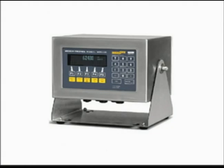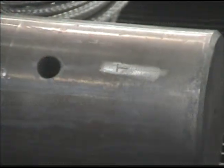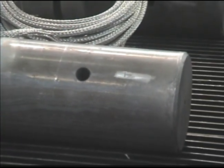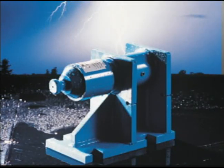Weight values can be expressed in pounds, grams, gallons, kilograms, tons, or liters. Weigh bars are manufactured from mild steel and heat treated to near aircraft quality standard. They are stamped with the letter T or the word 'top' to ensure proper installation. Due to the delicate nature of strain gauges used on analog weight sensors, it is recommended that no welding be allowed to the structure near an analog weight sensor.